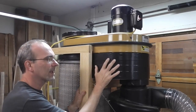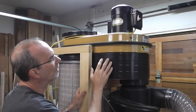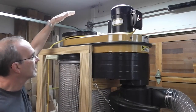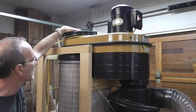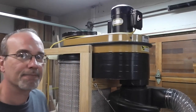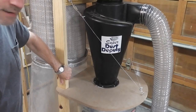That's underneath here. There are baffles on the inside of this. Inside here there's a ramp that goes down because I had to bring this out. I put a cap up on top here to cap off the top of the housing. I've got the donut with the cartridge that's screwed onto this. When I go down a little bit, the dust deputy itself rests on a platform that's screwed to the uprights here.